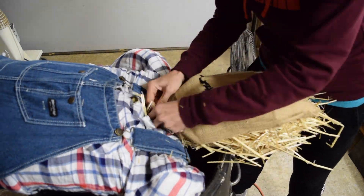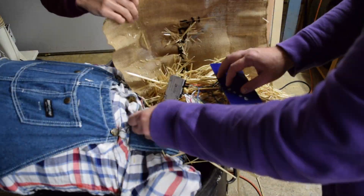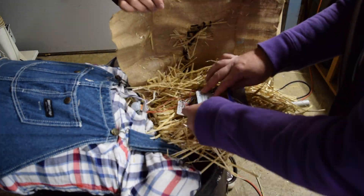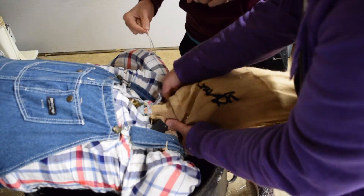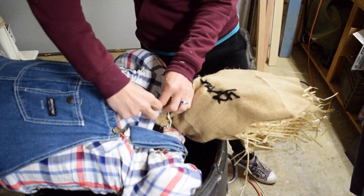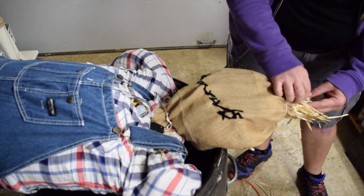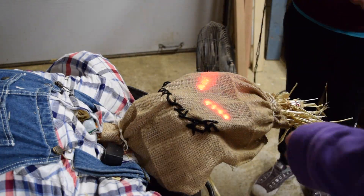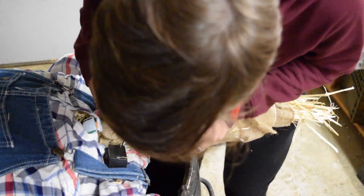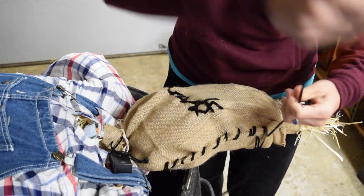I disassembled the head enough to install the electronics. I had planned on having a motor attached as well — something that could rattle or make noise to add to the scariness in the dark. Unfortunately, this was a tiny 5-volt motor that just didn't have enough juice to do what we wanted. The battery pack was stowed in his neck, and the motion sensor just near the top of the collar. After checking that it all still worked, I tied up the ends and sewed up the side of his head.